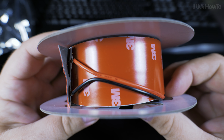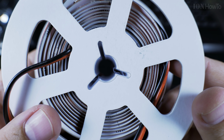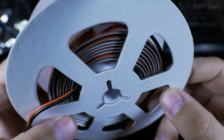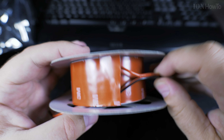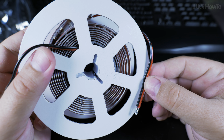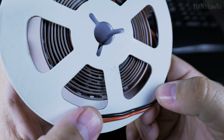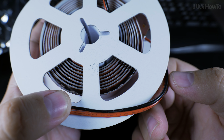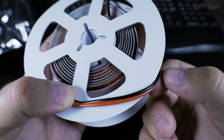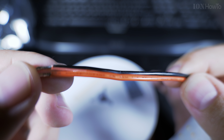Actually, I first thought it was 5 meters when I bought it. 48 watts per meter — that's a lot of watts — and also the lumens. I think I missed it at the beginning, but it's about 7000-something lumens total. The wires have a brand name on them, might be the factory name. 18 AWG wires — the wires are pretty good. Also the soldering on the pads is really nice and shiny.